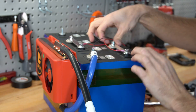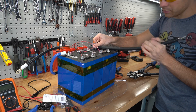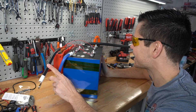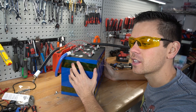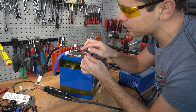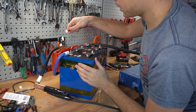I like how large these cells are — it is easy to organize the cables. For the positive terminal we're going to use four-aught gauge copper wire. I do not like working with 12 volts; look at these cables, this is ridiculous. We should be able to pull 250 amps with this thing. Before we activate the BMS, we're going to ensure that each conductor goes out to its appropriate cell, because if you mix one of these wires up you are going to burn out the BMS instantly.